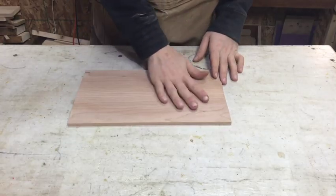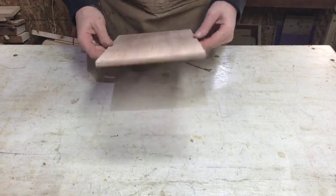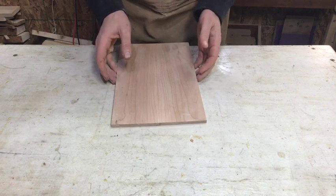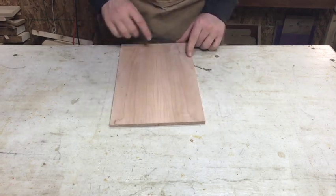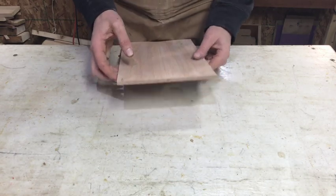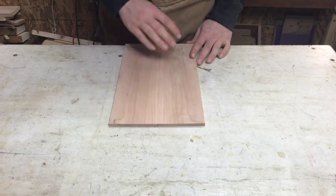Now that we've got our lid sanded almost all the way, we're going to trim off the edges and square this up just a little bit. When sanding, especially with the random orbit sander, you can roll over the edges a bit, which will really mess with our cutting of grooves since we're going to cut this lid down to the perfect size to fit. If these edges are rounded over, our groove is suddenly going to be a lot tighter than we want. Just take a little bit off on each side and square these up at the end. If you have a book-match lid, keep track of the center glue line so you take off an equal amount from both sides.